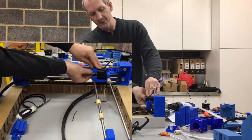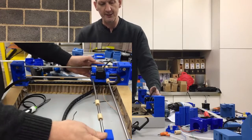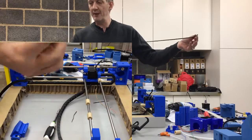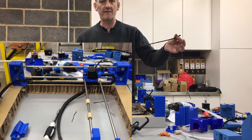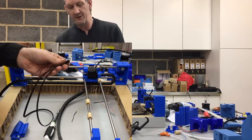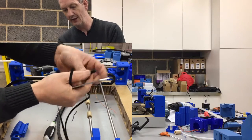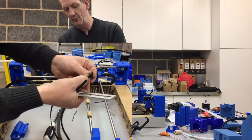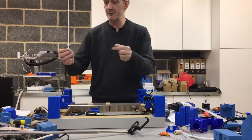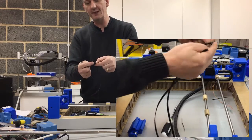The X motor is in place. With that dead level, it should now be nicely in line ready for me to put the belt on. The belt is a GT2 belt, cut to a length of 950mm. We've folded over approximately 15mm and put a cable tie around it to lock it into place, so the teeth are against each other with a small black cable tie to lock it at approximately 950mm.